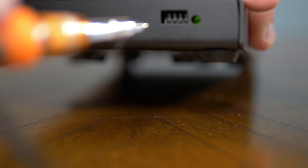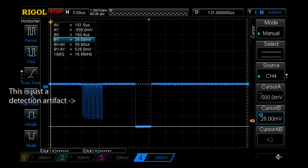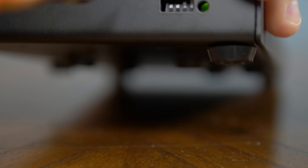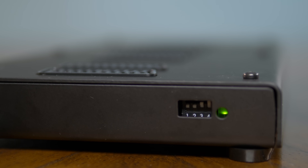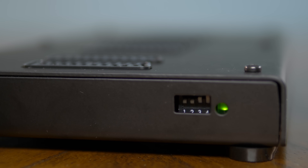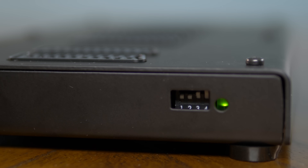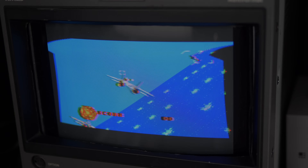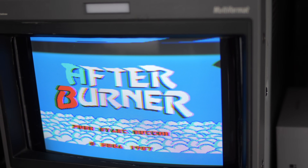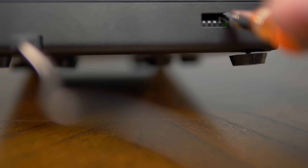The latest GSCART has two types of sync regeneration adjusted with jumpers. Toggling the first one will strip the signal of any information that isn't sync, and the voltage is still perfect for use with SCART devices. Toggling the second switch will convert sync on green to RGB-S — the most common scenario for this is using the PS2 in RGB mode to play 480p games. If you have a full RGB setup, just toggle this jumper and the switch will automatically convert it to RGB-S. The third toggle is a special sync regeneration that fixes Sega Master System sync on monitors with compatibility issues, though it doesn't fix PC Engine sync. The last toggle switch is for the LED light.